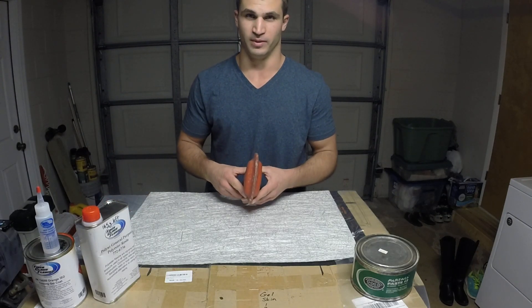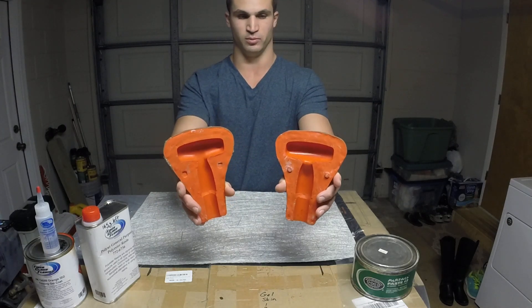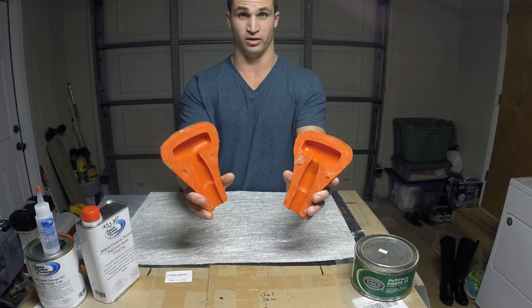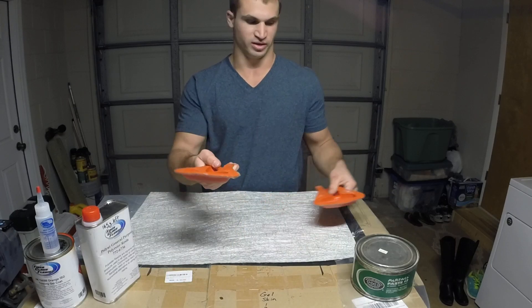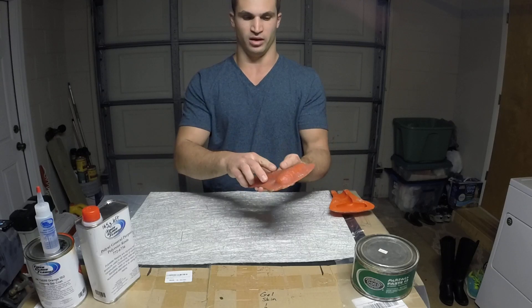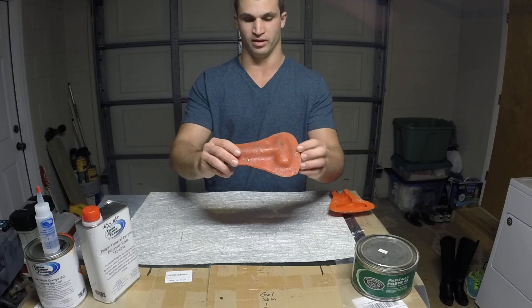To give you an example of the mold I'm going to be making in this video demonstration, I want to show you this split mold that I made in the past. It's for a paddle board paddle handle. It's got a gel coat surface for the molding surface and it's built up with chop strand mat, fiberglass, and polyester resin.